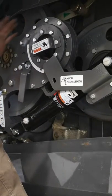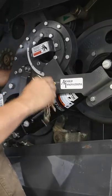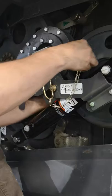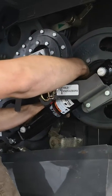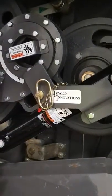With the ratchet head pinned to the cylinder, you can install the hitch pin that comes with the hook. This is to retain the ratchet head when it's not in use. We're going to put it in at this point in the assembly just because we're going to be working to install the hub and we don't want the ratchet head to move. It just gets installed like that.